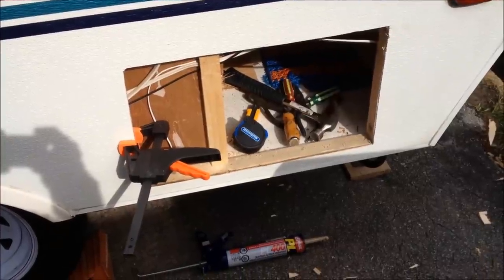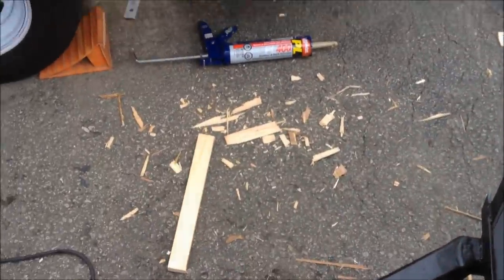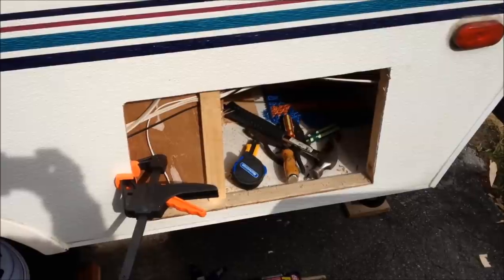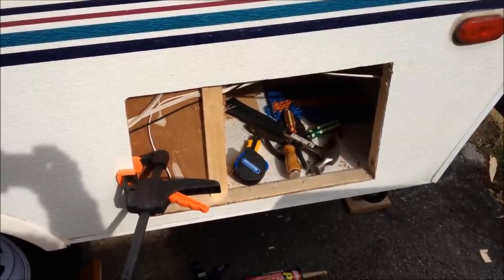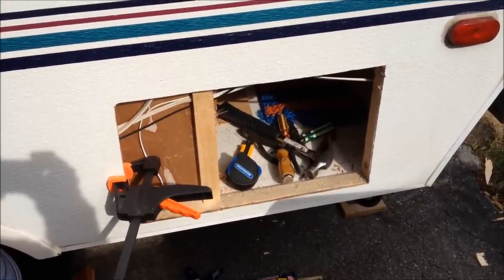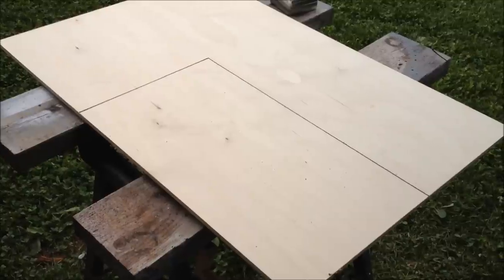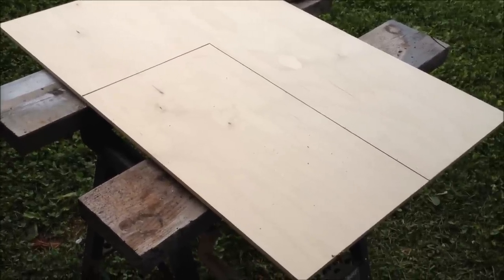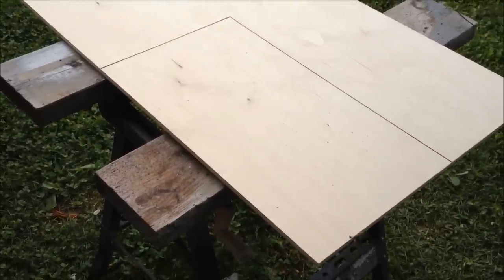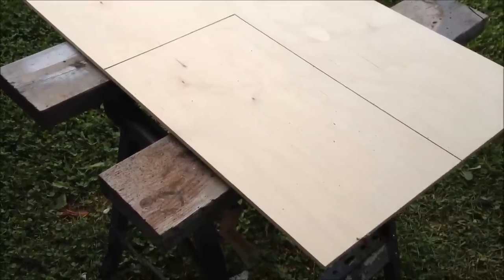Right now I'm in the process of reinforcing the whole opening. What I'm doing is taking some 1x2 stock, cutting it, framing it, then using some industrial adhesive — PL — to hold it into place. This will just give it a little more rigidity around the opening. I already have framing on the bottom and on the right-hand side; this is just to secure the top and left-hand side. Now I'm going to be cutting the wood which will become the new structure for the door. As you remember, the door wood that was inside was all rotten and sawdust. So this is just 3/8ths ply that I'll be painting to weather seal, then encapsulating inside the vinyl and aluminum housing for the door.